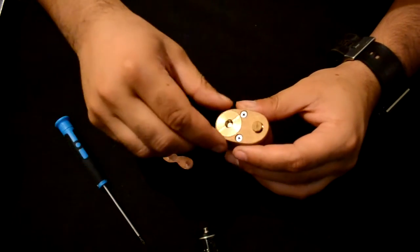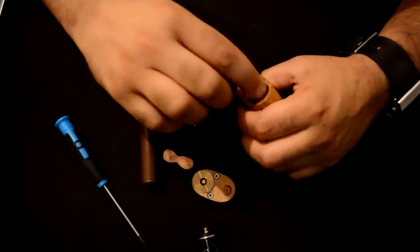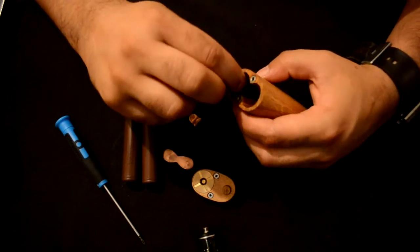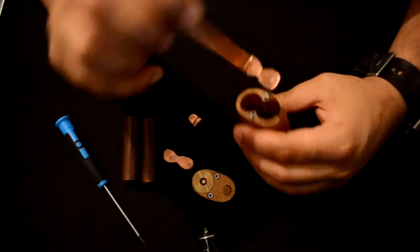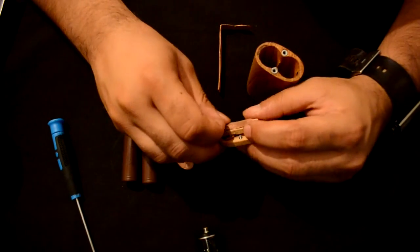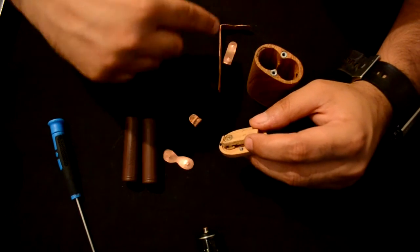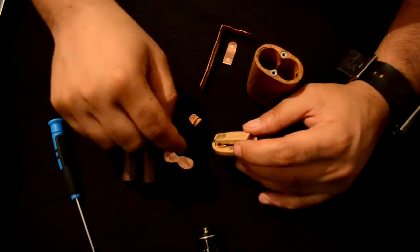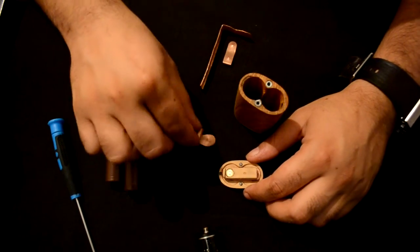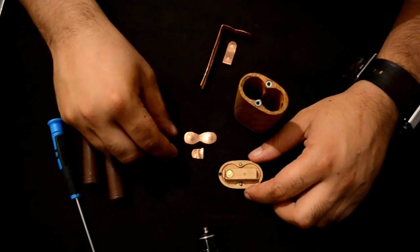One, two — batteries out. Now the plate out, and we need to remove the long plate from the cap. So these two plates are for 4.2 volt mode. To set it up in 8.4 volt mode, we need now these — the second of the brass plates, the H-shape, which has those nipples. I like to say nipples — nipples up top. So they go in first, and you only need to make sure the nipples are pointing up.